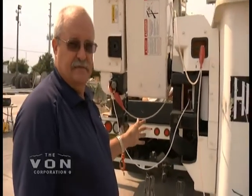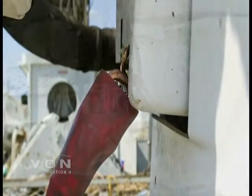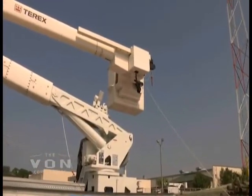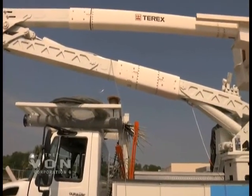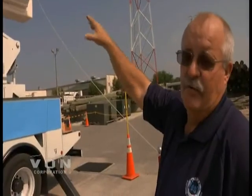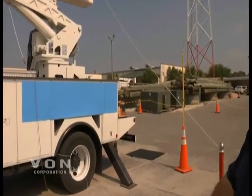Every manufacturer designs their trucks differently. When out in the field testing bucket trucks and digger-derrick trucks, you will find several different types of mounting of the buckets and boom tips, making it necessary to attach to all metal parts with your high voltage leads. We have connected the upper boom with the three-way high voltage lead and the lower boom chassis with our single high voltage lead, and we have grounded the lower part of the boom. When we finish testing the upper boom, without moving the unit, we will disconnect this lead and energize the next lead to test the lower chassis.